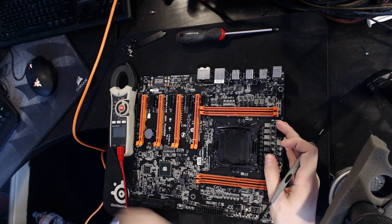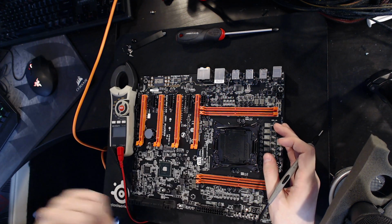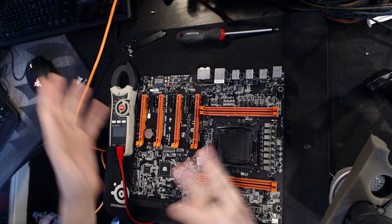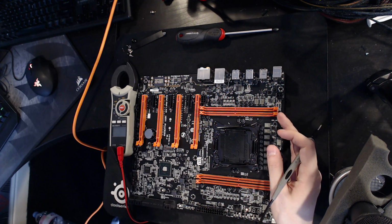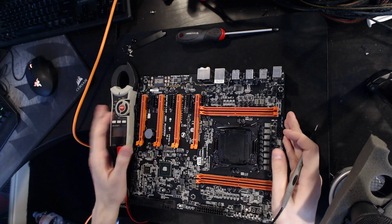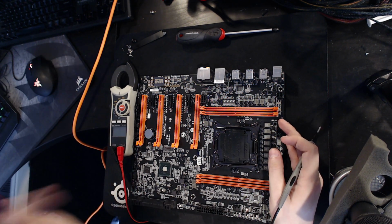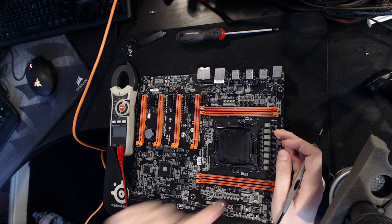Now, there is a benefit to the fully integrated voltage regulator in that, say, a Haswell E 5960X or a Broadwell E 6950X on liquid nitrogen at full load, so we're talking like Cinebench or XTU, and for Broadwell E, around 5 gigahertz core clock, and for Haswell E in excess of 5 gigahertz, like 5.5, maybe even 6 gigahertz. At those kind of core clocks, 5960Xs and 6950Xs will pull between 500 and 600 watts. And the bonus to the fully integrated voltage regulator there is you only have to push at 2 volts, so for 600 watts of power, you only have to push about 300 amps of current. If we were at a lower voltage, this would have to push 600 amps of current, and there's simply no way these power stages are doing that because their package won't allow it.